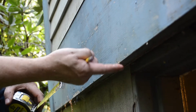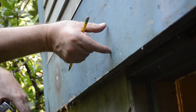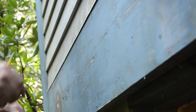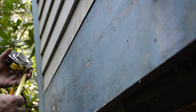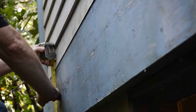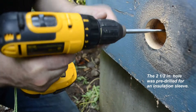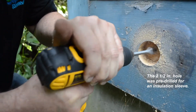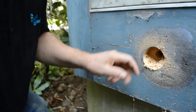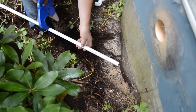It's about an inch from the bottom of this board up to the bottom of the sill, then three inches for the sill, and then I want to be another inch and a half above that. So that's three plus one plus an inch and a half, which gives me five and a half inches total.